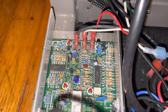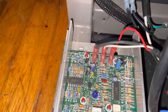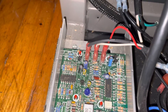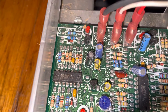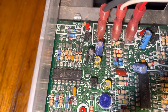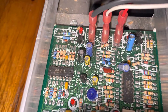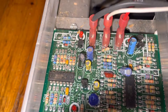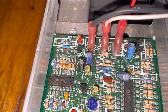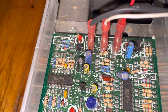But if you plug that safety switch back in with this modification, it will restart at the same speed it was last at — you don't have to put it back to zero. Research reveals that for this particular controller, if you remove resistor R19, it will not require going back to zero. R19 is right there — you can't see it until you cut the resistor out. I just took some wire snips, snipped the lead, pulled the resistor up, and now it does what I want.